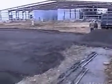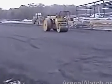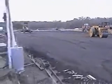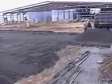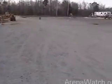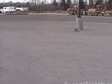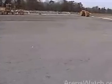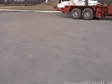Here the parking lot's being prepared for asphalting. The base is going down. Here the parking lot's ready for pavement. That'll be taking place this following week. We wanted to get that done before the weather turned bad. Today we're about October 30th, Halloween. Light poles are in place. Typically the lighting poles for the parking lot are rated at 3-foot candles for all places in the parking lot.